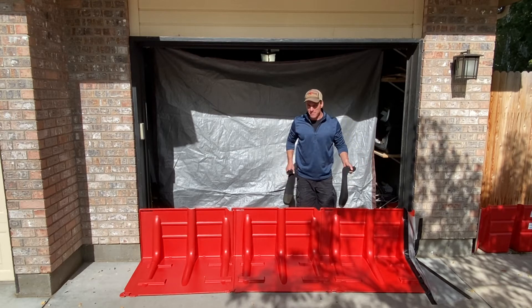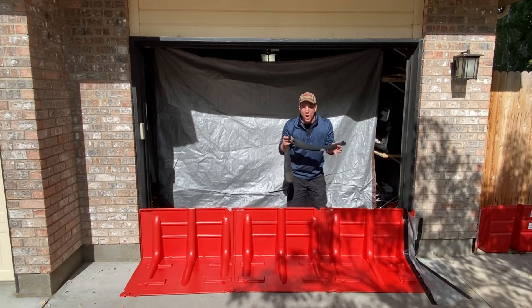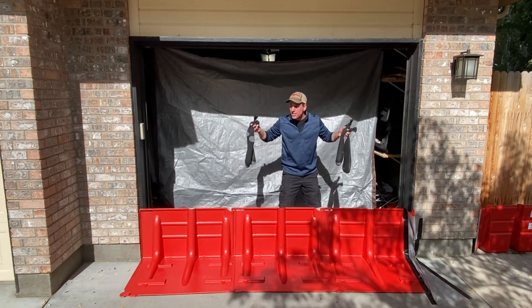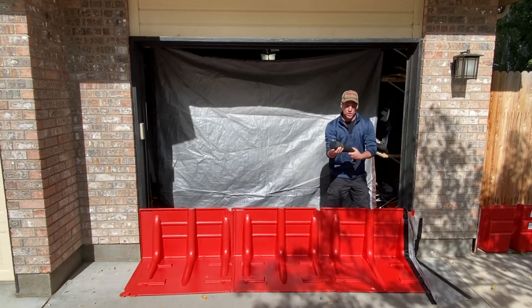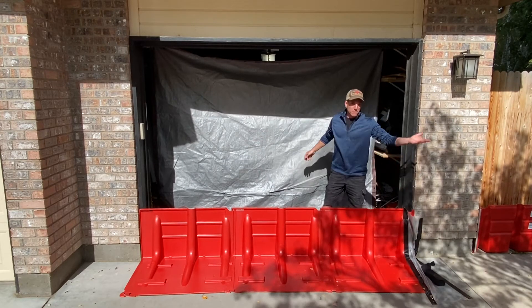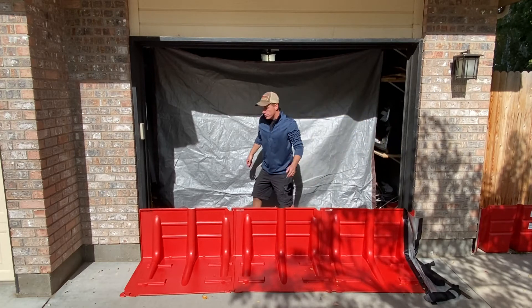Sometimes you might find that the ground surfaces are wet, so you can get a good seal to the ground with the plastic by using sandbags. Sandbags are really heavy, so you don't need a full sandbag — sand socks are wonderful. I have four sand socks, which is less than half a sandbag of sand. You can easily stretch them out and put them on the plastic. It's a fantastic technique to get a good seal to the ground.